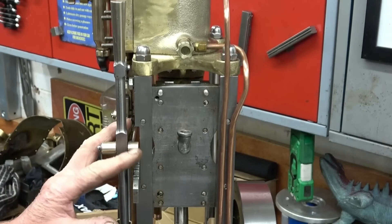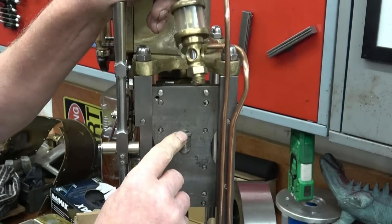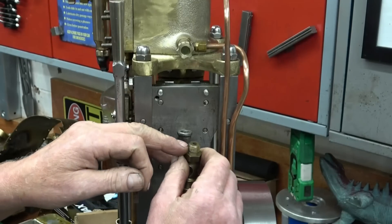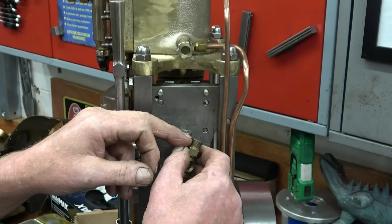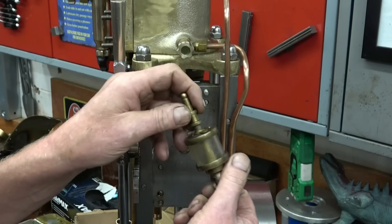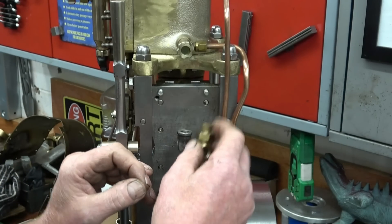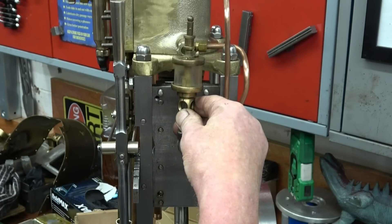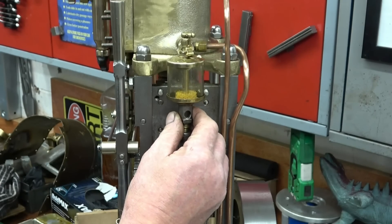On the last video with this little marine engine I decided I was going to put that drip oiler in there. That's 1/8 BSP and unfortunately this one is quarter BSP, but I think there's enough material on there to turn it down and put a 1/8 BSP thread onto it. I'm going to take it apart, show it, and go about mounting it in the lathe — machine that down, put some threads on. I think it's going to be just the right proportion, and it's certainly a lot better than the cheap Chinese one.